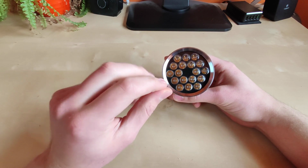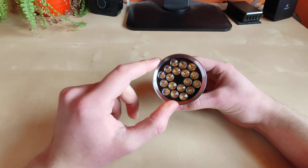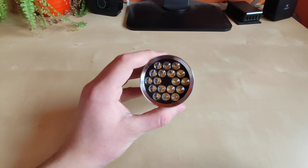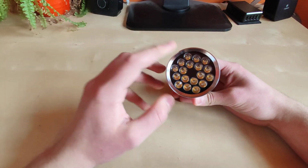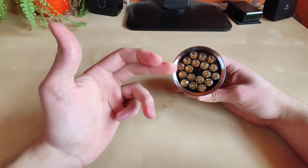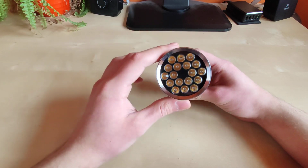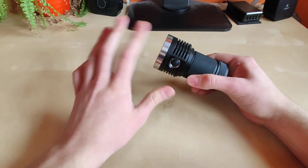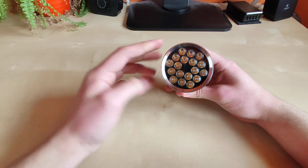I've heard that the bin of the LEDs that Hank sourced for this flashlight was with letter B, so this is a little bit above the BBL line, and actually the Astrolux in their MF01S got the better bin, so basically more rosy, less green, but you can actually order some 3000K LEDs, where the green in the beam is almost not noticeable. Only some tint snobs like me can actually see that and might be irritated by that, so that's definitely not a major problem.